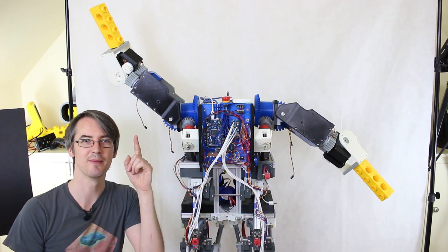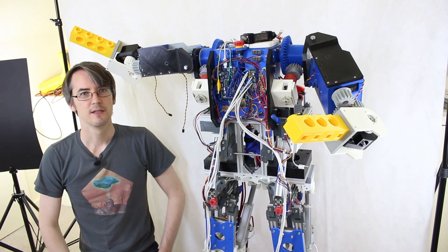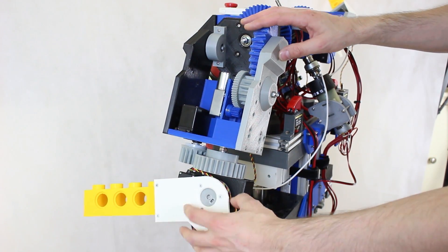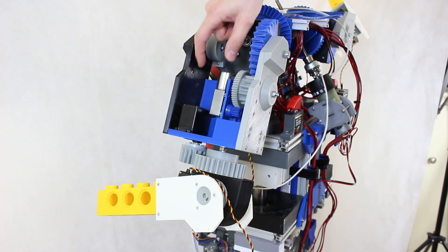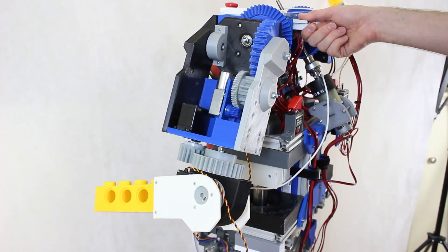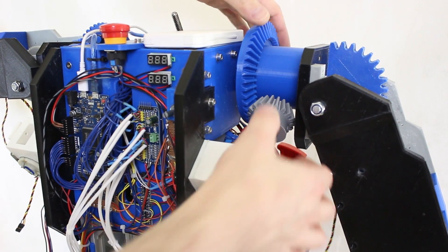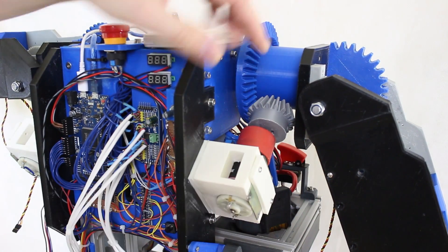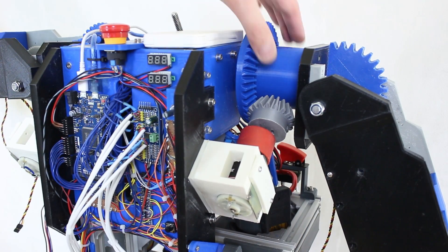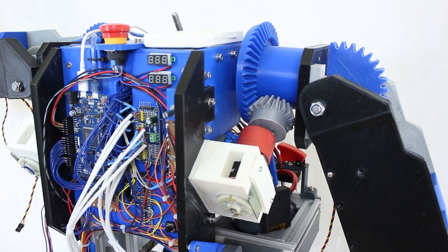I've installed some temporary forearms made of giant LEGO bricks - check out my giant LEGO hyperreality blaster project to see more about those - but you can see it can do some quite extreme poses. Should be pretty good for dancing. The servos and gears mesh pretty well so that'll be easy to control. The only problem I have is wobbly arms at the very first joint. The gears mesh okay, but there's backlash in this geared motor - you can actually see it moving there. That whole leverage down the arm causes wobble, so I probably need to do something different. I think I'll get some worm gear gearboxes with a right angle and use a spur gear instead of this bevel gear, but I haven't got time to order them for this video.